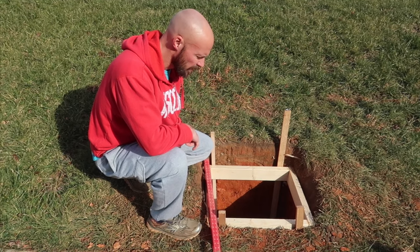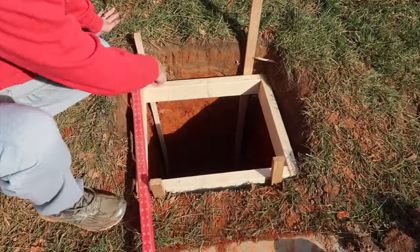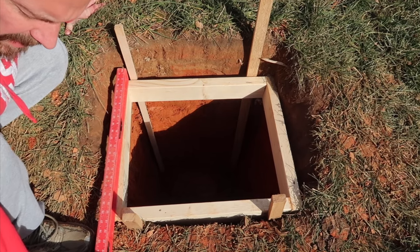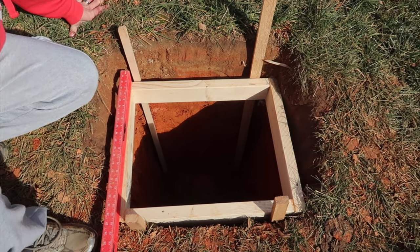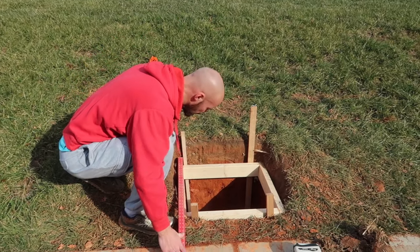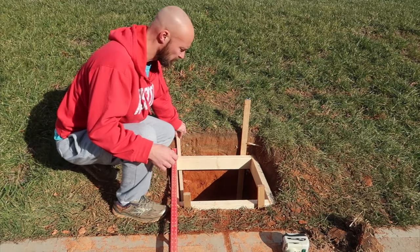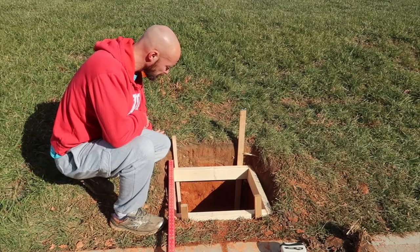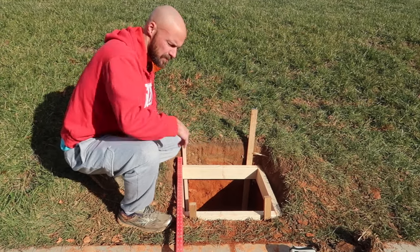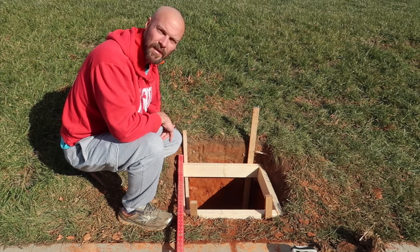We're at the point where we're going to frame up what our box is going to look like for pouring the concrete, to get a nice square box in the ground. When we pour the concrete, we'll pour it level to the top of this frame. The directions say to level this to your playing surface, because the hoop goes onto this. My playing surface is my driveway. I've got a four-foot level and I'm just going to level it across, hammer posts in, and put a screw through on the inside to make sure it stays level while we pour. Then I'll pull the frame out and have the concrete in a nice square pattern.